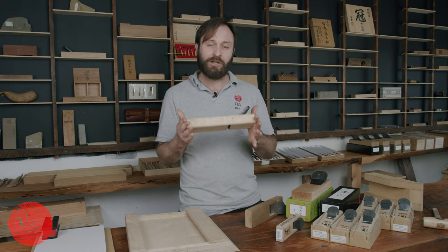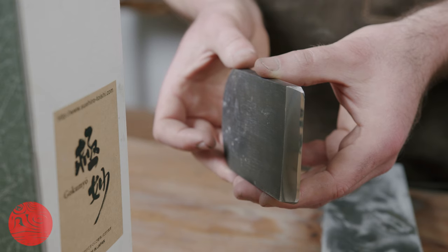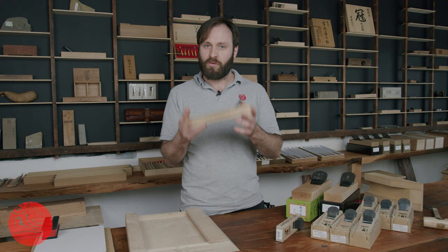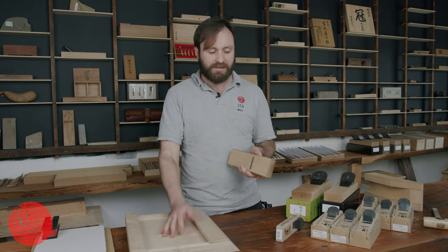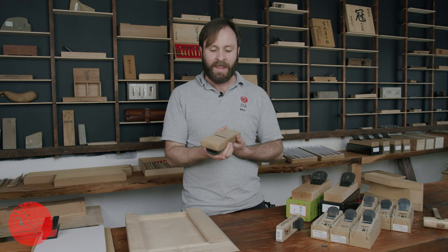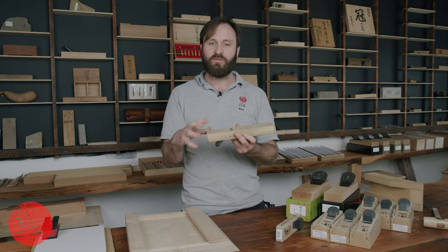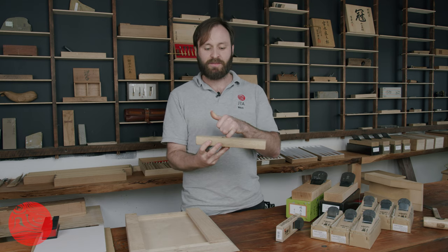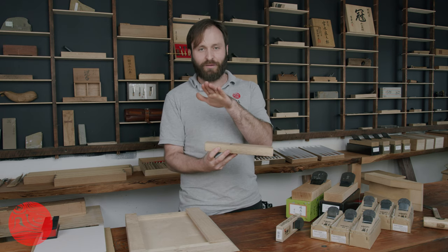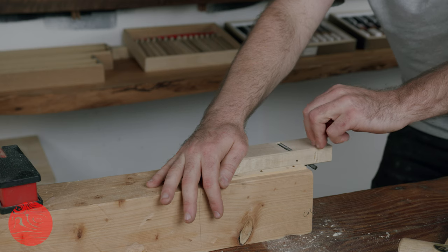This is a really good opportunity to develop a beautifully tuned smoothing plane to your own specifications. The plane I use almost all the time for jig-based work is this Yamamoto plane, which I've profiled to have three contact patches. What I've noticed is that those three contact patches make this plane much more sensitive to movement. Any movement behind the block means the contact patch in front of the plane can lose contact with your timber, so I find myself tuning this back very, very often — much more often than I have to tune a smoothing plane.